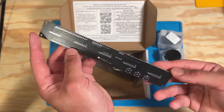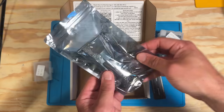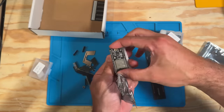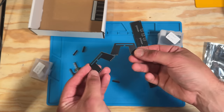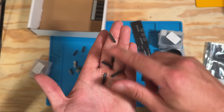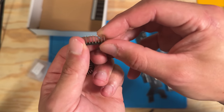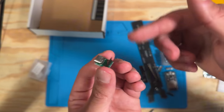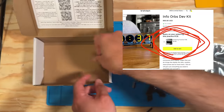Next you'll see the PCB with no components on it yet. In a bag you'll find the ESP32 itself — a special 38-pin narrow version — plus the PCB feet, two female 19-pin connectors for the ESP, five 7-pin female connectors and five 90-degree 7-pin male pin headers for the screens, three push buttons, and a USB-C port. We'll talk about some asterisks with the USB-C at the end.